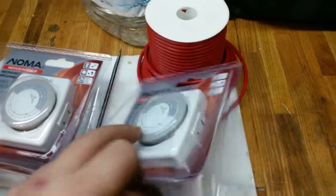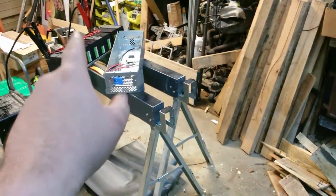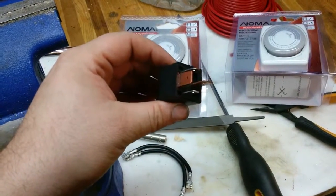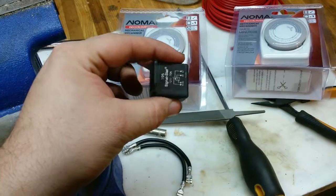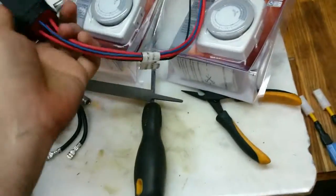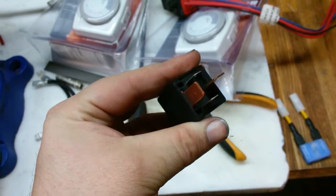Since this is 120 volt out and the batteries are 12 volts, I'm planning on having the batteries run through a relay. I've got this one laying around — it's a 70 amp 12 volt relay, which is a little much. I only need to discharge like an amp or so, not 70. But I do have a smaller one actually — a standard automotive relay, just happens to be insulated with nice pigtails on it. We'll go with this one.